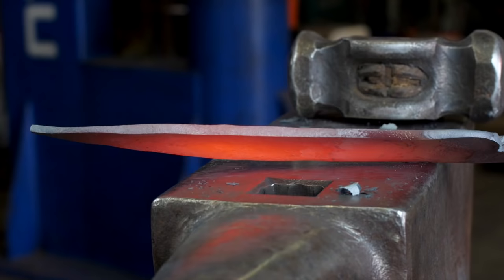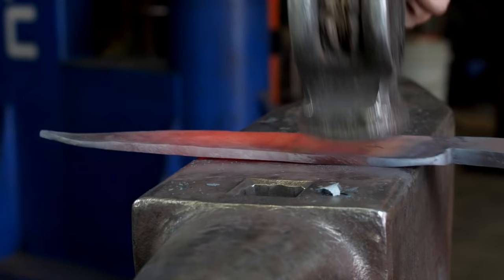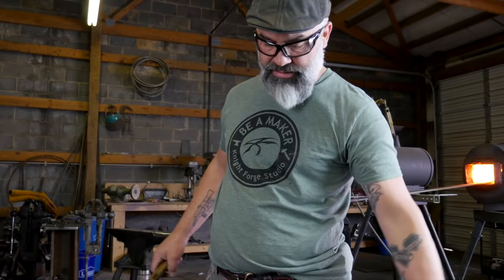Next heat — if you look, you can see how thick the edge is. Now I'm going to go back and work that piece. I'm working in the center at first, all the way down on both sides, then I'm going to go back and pull that edge down. During this process you may find that your preform changes — bends somewhere out of control. Get it back into shape while it's still thick. I always keep the anvil clean. Wear safety glasses.